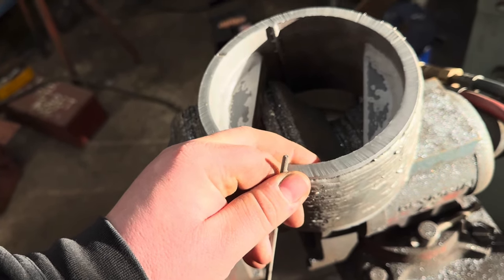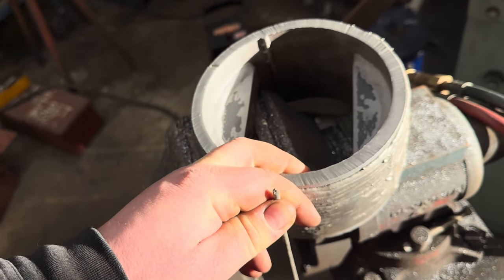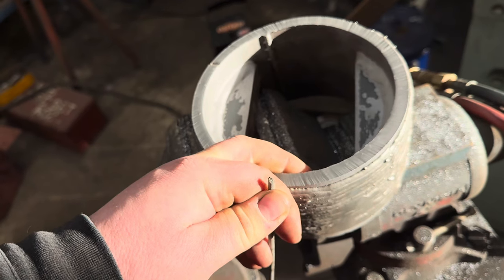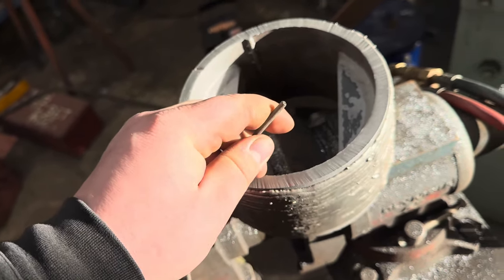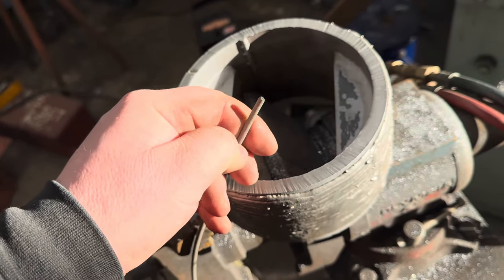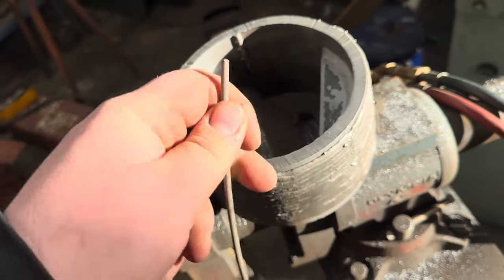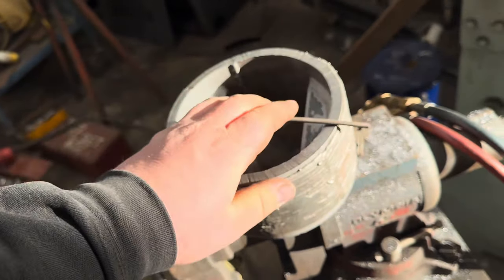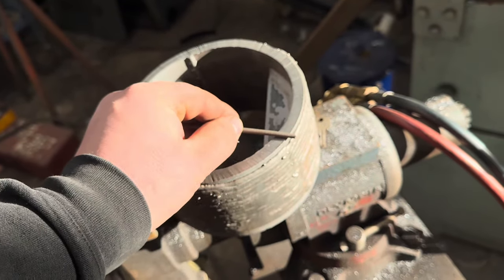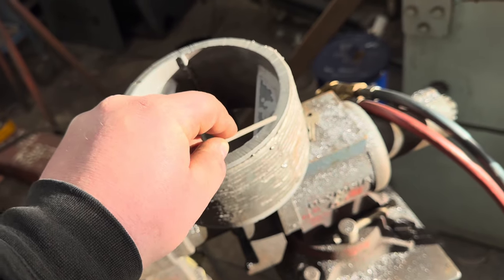When you heat this under oxyacetylene, the core wire, which is a sort of eutectic type material, will melt, and then the tungsten carbide is actually contained in this fluxy sort of coating. The wire rope's very flexible. It can actually be fed by hand, or it can be fed by torch and inched out, and it is basically just applied like this,